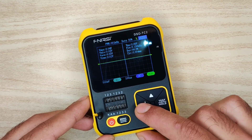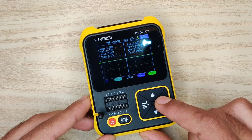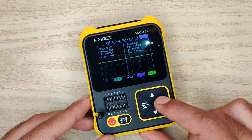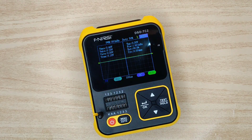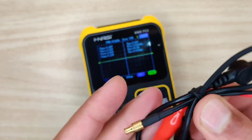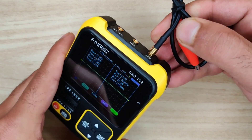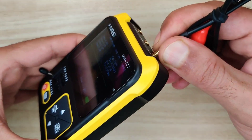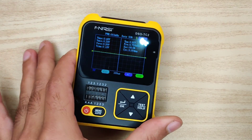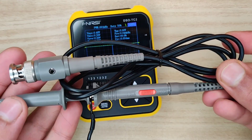In the vertical voltage gear position, you can long press this button to change modes: 1x, which supports maximum testing of 40 volts, and 10x, which supports maximum testing of 400 volts. The included alligator clip wires come with a connector that can be inserted directly into the sockets to test waveforms up to 40 volts, voltage up to 16 volts, and output PWM up to 80kHz.